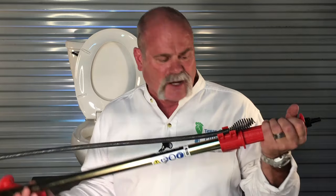If you're starting to get water back up in your shower or bathtub, the blockage may be further down — it could even be your whole main. What you want to do is keep an eye on it. If it's just your toilet, chances are with a plunger used the right way or a closet auger used the right way, you might be able to take care of it yourself and save some money. If you like these videos, please click on the subscribe button and leave a comment below. Let us know if you've got a closet auger and if you use it. My name is Roger Wakefield with Texas Green Plumbing, saving you money one drop at a time.